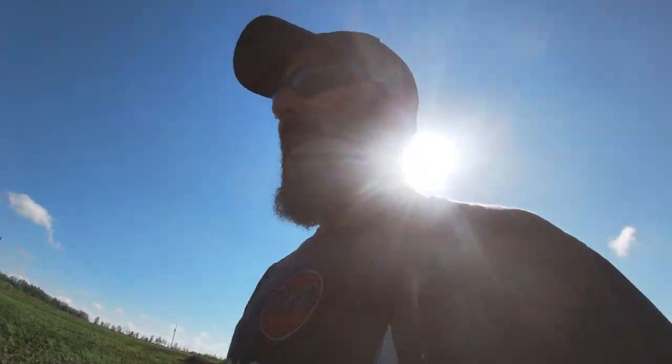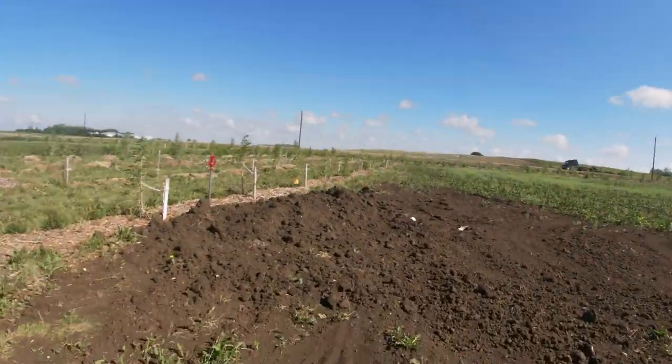So there's two sides in the septic tank. There's a solid side and a gray water side. And the solid side is pretty much always full right to the top. And as you flush your toilets and drain your sinks, it all falls into the solid side, and then just the solids settle down to the bottom and the water flows over the top of this little wall in the middle. And once that gets up to a certain level, your septic pump kicks in and pumps it out.